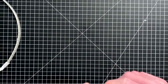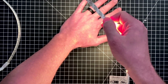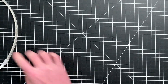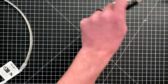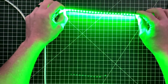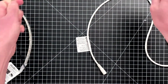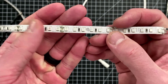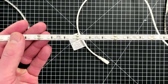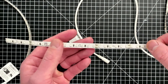Here is Blaze X — still 200 lumens — a little bit warmer colors. The red pops a little bit more in person; it doesn't show nearly as much over camera. And here is Blaze Colors in green — really good color rendering still. Since I'm using 24 volts, cut points every two inches. It's still only two-wire, which is why you can use it with our terminal blocks. Really easy and cost-effective for applications where you need some color but only a single static color.